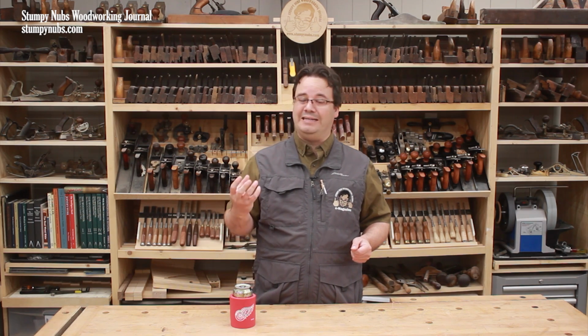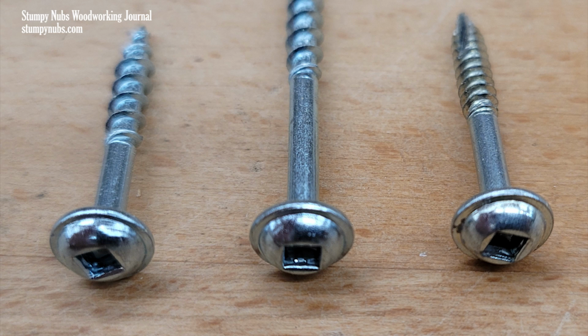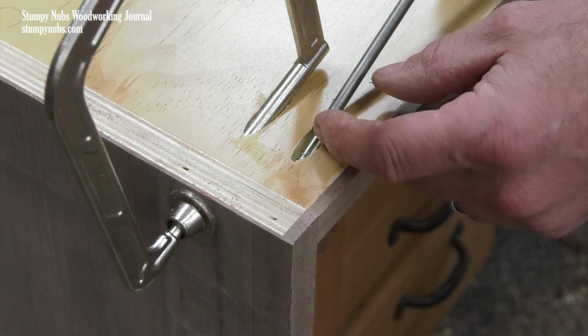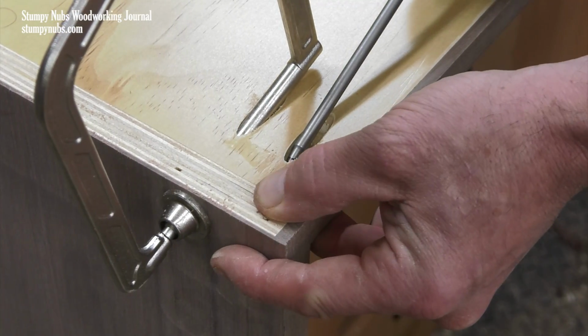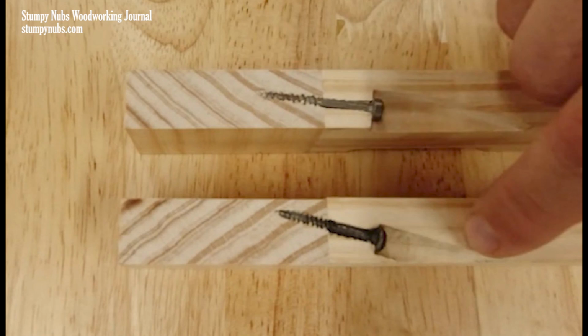Washer head screws are easier to strip within a hole than fillister head screws are. On the other hand, the larger diameter of a washer head provides more surface area, which some claim creates a stronger joint in materials such as particle board and melamine. A washer head, though, does require a larger pocket than a fillister head screw, and its shape is more suited to jigs that create drilled pockets than those that cut routed pockets.